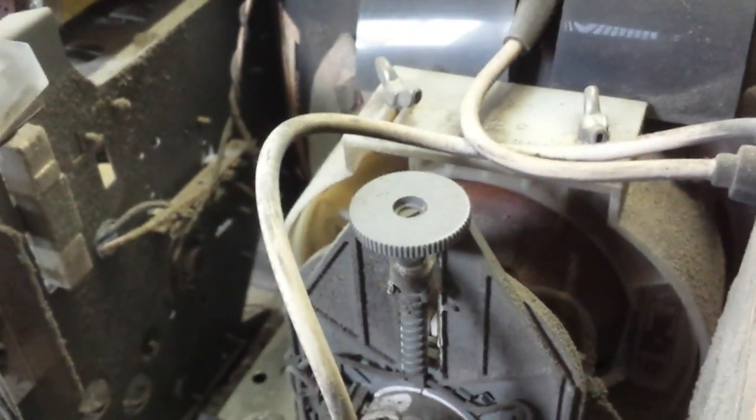One more thing I find neat about these Trinitrons is the multitude of adjustments that are on them. At the very least, you get ones for the screen and for the drive, and then you've got ones for horizontal and vertical and all that sort of thing. But then there's more than that. There's your focus adjustment there. There's your convergence adjustments there. Your focus is down here on the CRT neckboard.